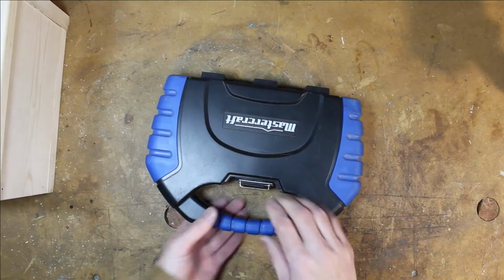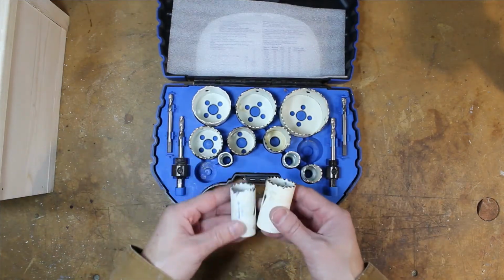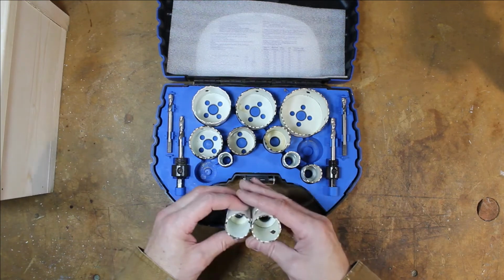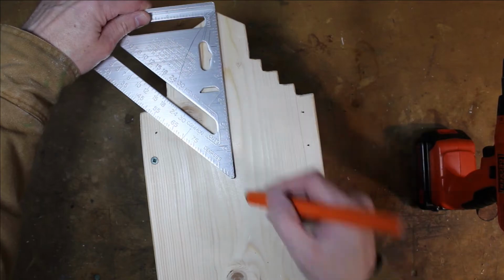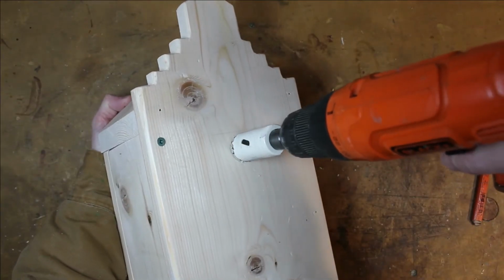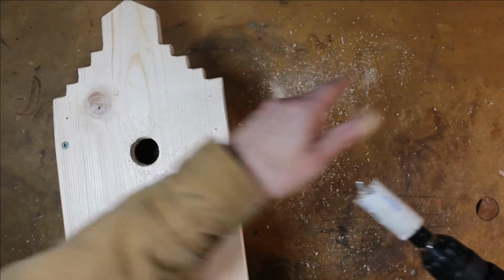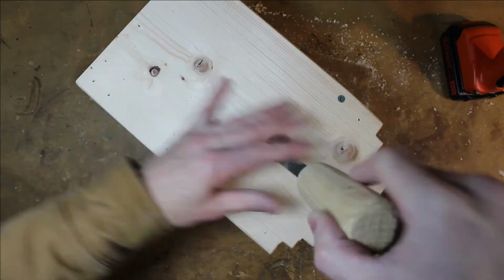To cut open a hole entrance for the birds, I'll be using a hole saw. The size of the hole you cut is important. It will determine which birds choose to use the birdhouse, so know ahead of time the type of bird you would like to attract to your birdhouse and cut the entrance accordingly. I'll leave a list of some of the common entrance hole sizes in the description below. I'm hoping for some chickadees to take up residency in this house, so I'm using a 1 1/8 inch diameter saw.